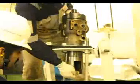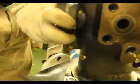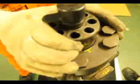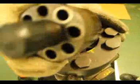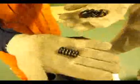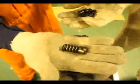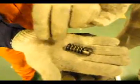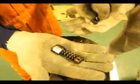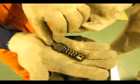Reset the fuel pump back to its original seating position and loosen the deflector. Remove the socket head bolts on the delivery valve holder. Remove the valve holder carefully so that the delivery valve parts do not fall down. The delivery valve consists of a delivery valve spring, spring seat, discharge valve, return valve, and a small delivery valve spring.